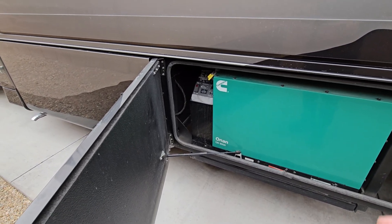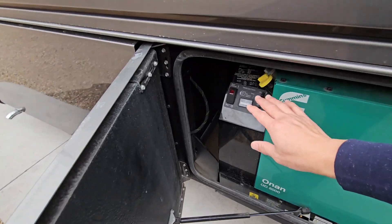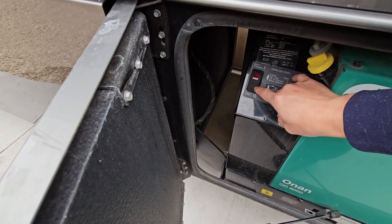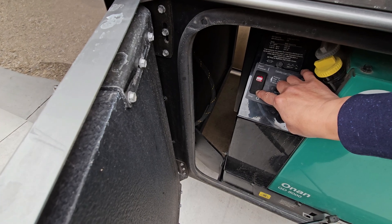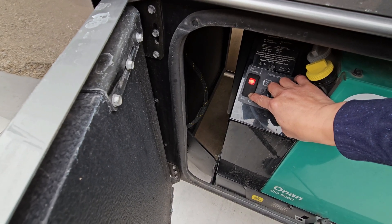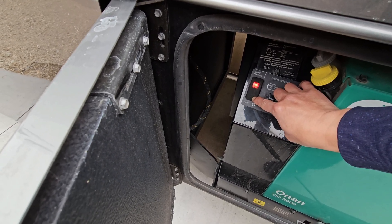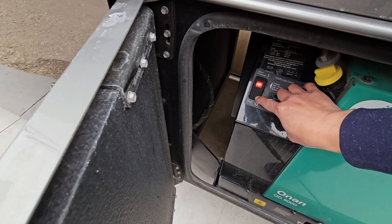It's about mid-40s right now, and we're going to wait until it gets a little bit colder. But let me go over some procedures. If you've ever had a diesel generator like this, you'll know that if you hold the bottom button in, you hear that clicking — that's actually the fuel pump doing the prime cycle. Sometimes people think this is the glow plugs working, but that is not the glow plug function.